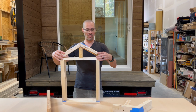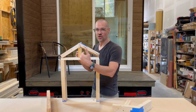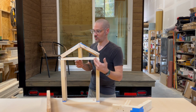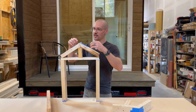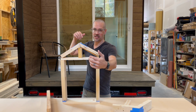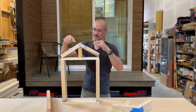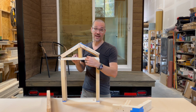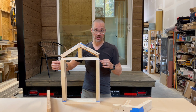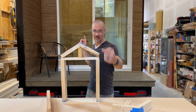And this is sort of what you end up with, a sort of truss. This is very traditional in post and beam architecture, where every so often the roof beam doesn't have to be as beefy because it is only spanning 12 feet or 10 feet or some amount, and you can reduce the size of this ridge beam and help share the load. Now this is the way that I see some tiny houses being built. This helps keep the walls straight and keep them from spreading, and help share the load down through those outside walls instead of all being borne on the end.